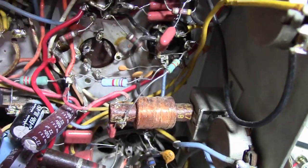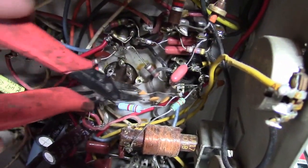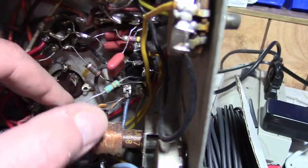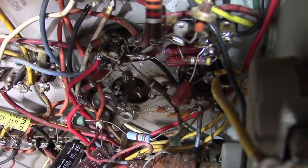Okay, yeah, so there are two 100 picofarad caps in series that are NP0, which is a 50 picofarad cap. So why did they put this little dinky guy? Well, that's got me thinking that they couldn't get this thing to run at the right frequency, so they were monkeying around with this. Could also be that these caps didn't have the best tolerance, and maybe they aren't quite 100 picofarads. Oh, it's hard to see. I think it says 33, which would really increase that to be well over 50, so that's odd.